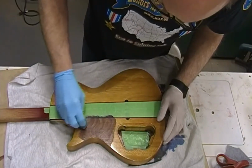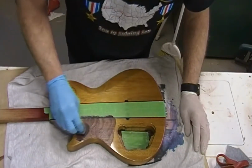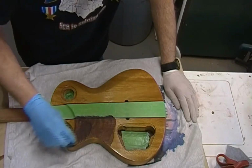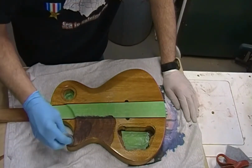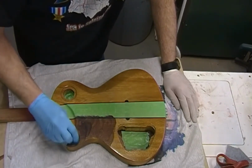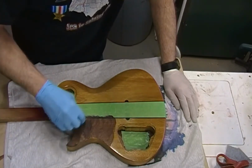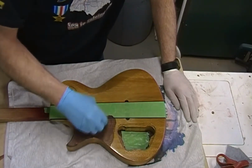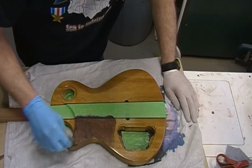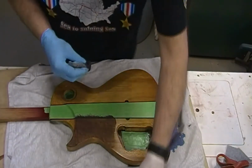I might just have to leave it on there pretty heavy, I'm not sure. Like I said, I've tried all kinds of different things with filling grain. I've done it a lot of times over the years, but typically if I was going to do a paint type instrument, guitar, I would use poplar for the body or alder, stuff that doesn't really need to be grain filled. The lacquer, the vinyl sanding sealer and the lacquer fills what little bit of grain there is on those woods up quite nicely. If there was a bigger defect, for whatever reason, you could cover it up with regular wood filler.